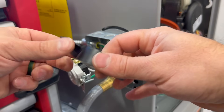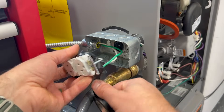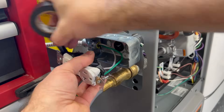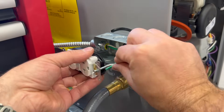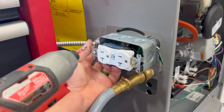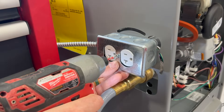Those connections are all done. We're going to do the same thing for the other wires, going under the screws and doing a few layers of tape here just to make sure nothing bumps against these and causes any sort of short. Everything is safe now, so we'll just push and maneuver the wires back to where they fit down in this box. Now we can go ahead and throw our cover on and this section will be completely done.